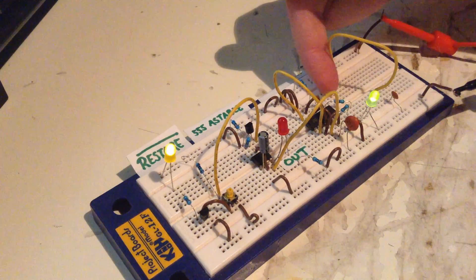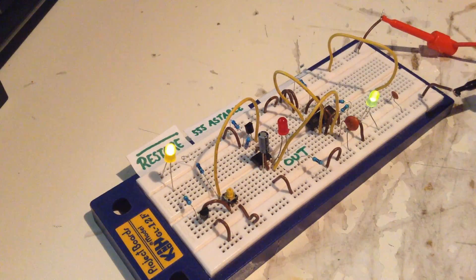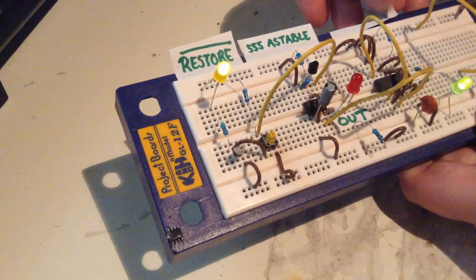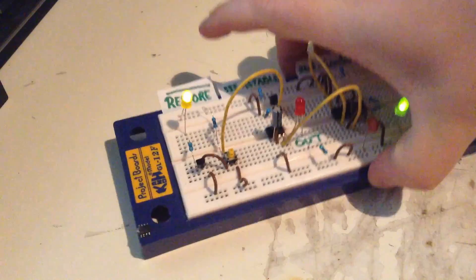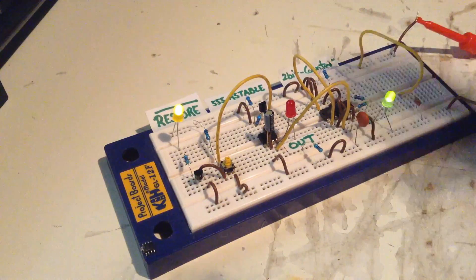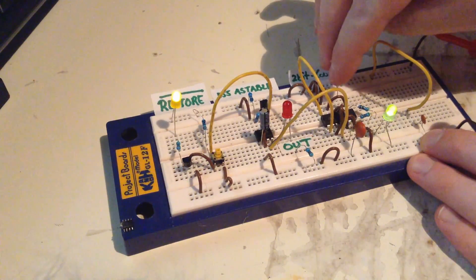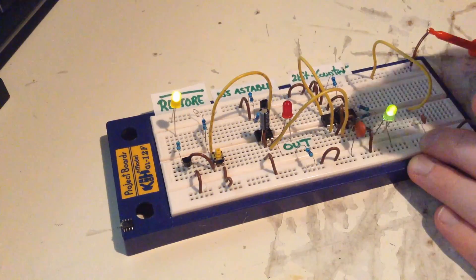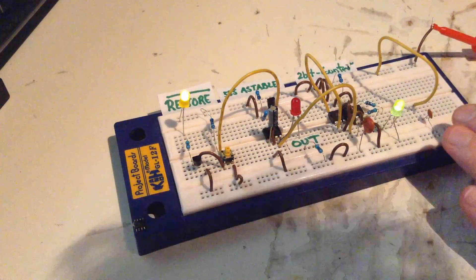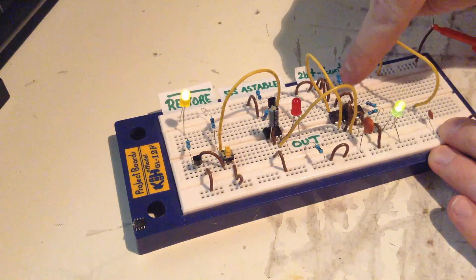I forgot to say that when I switched those resistors, we got harder current. So when they switch, they switch harder. And I think that's the reason why the circuit failed and not when we had the other resistor. Now, there's more things to this — remember I talked about the preset circuit. We have a pull-up on it, and then we have a capacitor. That was supposed to put a preset on the startup sequence, so this one holds the preset line low, and then slowly it will be charged up with this resistor.